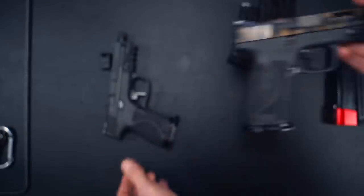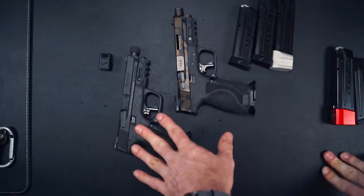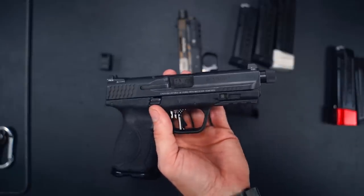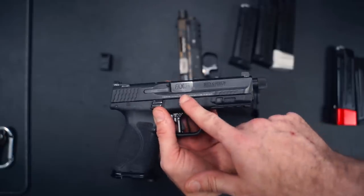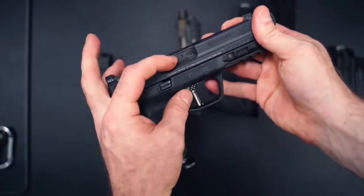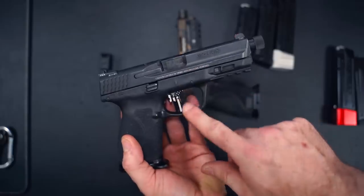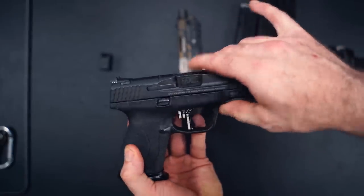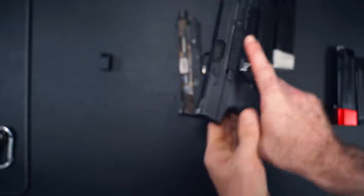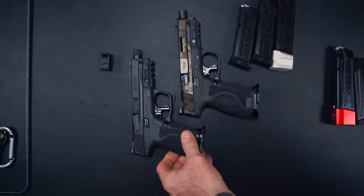I have the True Precision barrel in this one and the Faxon Firearms barrel in the other. I wanted to make a quick announcement because I made a mistake in a previous video comparing these barrels. In the Faxon video I said the Faxon barrel seemed to prevent early unlocking — a flaw where the barrel chamber drops before the round has completely exited, causing bullet shift. I was mistaken. The hood was fitting so tightly it didn't appear to have early unlocking, but after further testing it does in fact have the issue. The only barrel that doesn't is the Apex. I just wanted to clear the air on that.